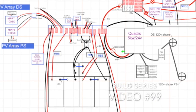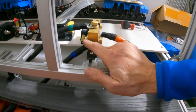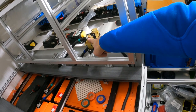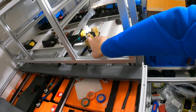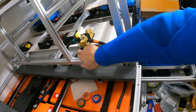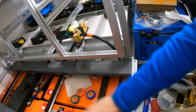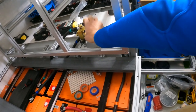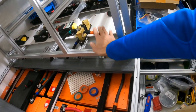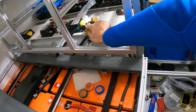Let's look at some examples and different ways to do this, and also why you'd want to. On one hand, I did a little angle adjustment here — that 90-degree lug I changed to almost a 45 — and it matches in perfectly. I may pull this off and bend this straight connection to give it about a 25 or 30-degree bend so the cable folds down nicely and gently, rather than an abrupt slope. I don't want tension on the lug or cable, which could cause fraying or wear over time.